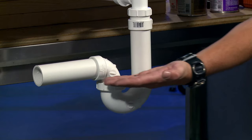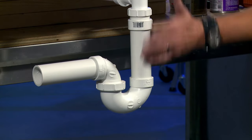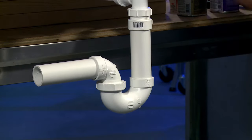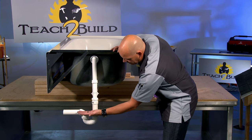You can see as this drain fills up with water, it will block those sewer gases from coming in. But once enough water enters the drain above this level, it will push that water through and keep the water moving through. When the water stops entering the drain, it will stop by filling up this trap one last time.